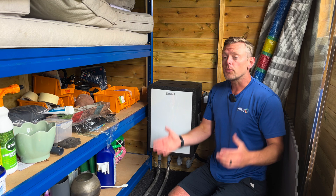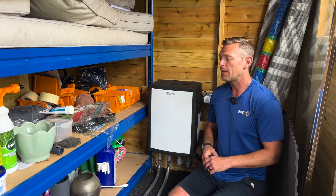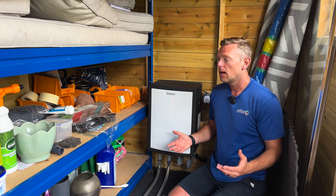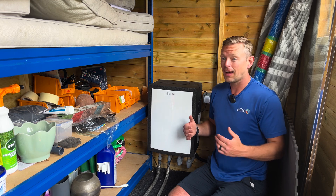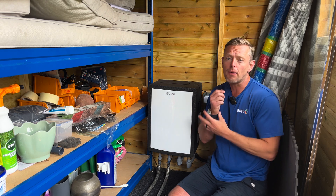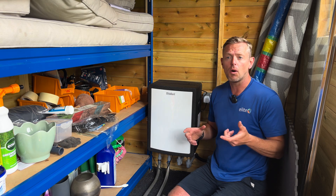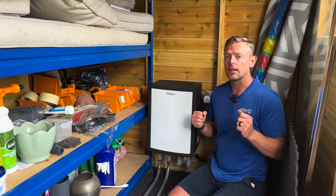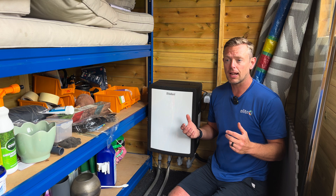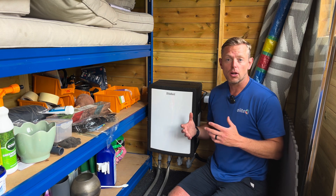My original idea was: we've got the heat pump up and running now, it had a great winter - 400% efficiency - really chuffed with that. It's come to the summer, we've got the PV going, and I'm giving a lot back to the grid. Obviously, being a tight Yorkshireman, I don't want to give back to the grid, and I don't want to pay for an extra battery yet. So before then, I had the idea of timing my hot water in the middle of the day, so I know that either I'm getting it from excess PV or I'm getting it from a full-up battery. That's worked really well over the last month or so, and I've really had no electrical costs whatsoever, especially when it comes to the hot water as well.